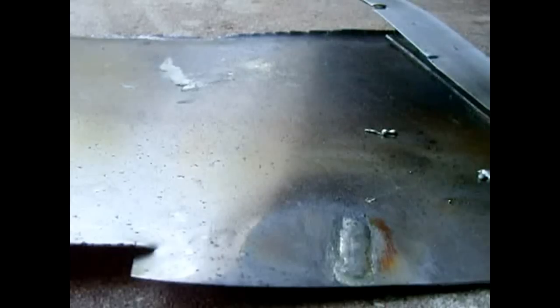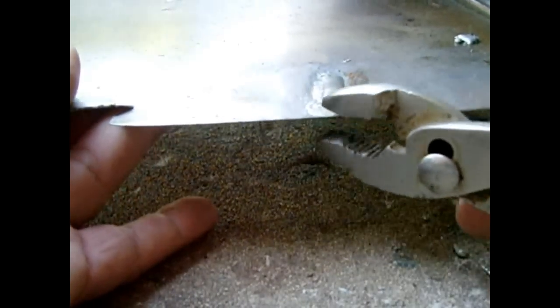The solder is fused now. As you can see, the solder took very well to the stainless steel. The trick is: once you see the solder starting to flow, you have to wire brush it into the surface. Once it's wire brushed in, you'll see it fuse. Once it's fused to the metal, then you can apply more. If you just touch one spot it's not going to work — make sure you apply the solder and immediately brush it into the surface, work it in, then apply more solder. I'm going to get a pair of pliers and bend on it. As you can see, it's not lifting — that is on there good.